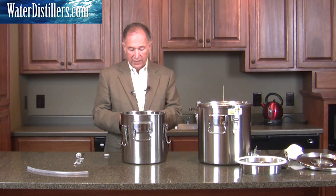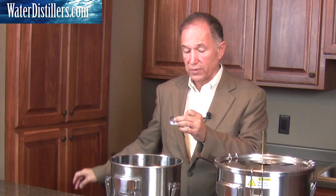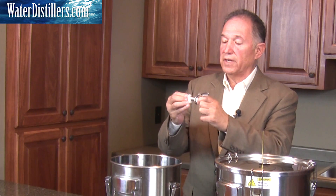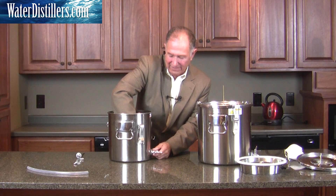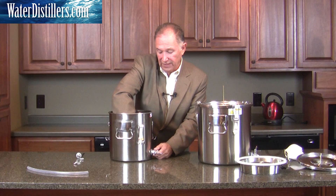So we're going to do the same thing — unscrew this and put the stainless steel component on the outside. We'll place the collar on the exterior; notice the bevel part is pointing out. Here's your gasket that we're going to put on to the exterior, and here is the nut and gasket that we're going to be putting on to the interior. Same exact procedure as we used before. We'll stick that in, and when you have it as tight as you can tighten it with your hand, clamp the bolt on the inside of the nut with your fingers.